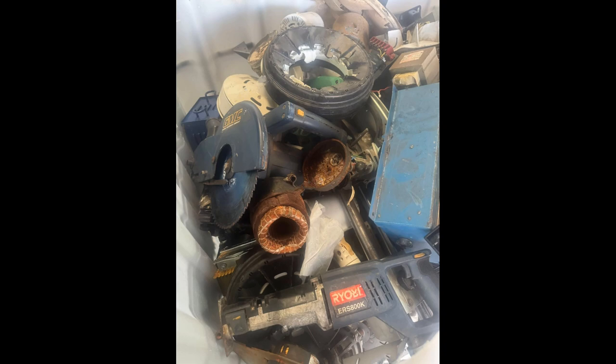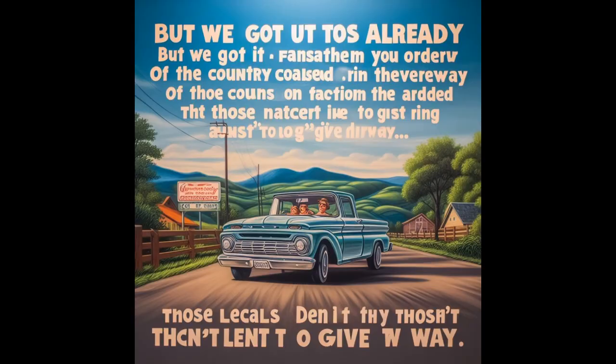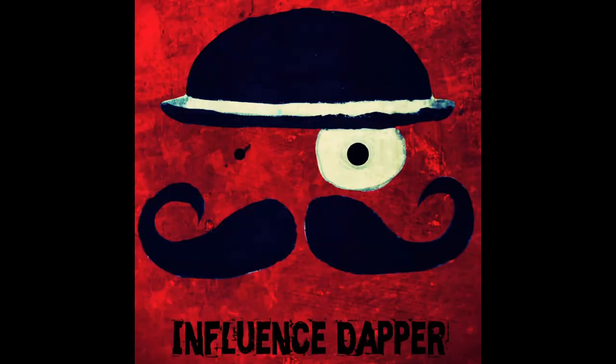The theory in this case is to dissolve low-quality and high-quality mixed aluminium scrap from different grades of aluminium, including aluminium that may reside in alloys or mixed scrap metal that may contain other metals. The dissolving process is a method to filter the aluminium recovered to a relative uniformity of purity, before introducing the powder into the crucible in order to cast high-quality ingots that will sell for more money than directly casting scrap ingots, without the need for laborious dross removal processes and multiple melts?